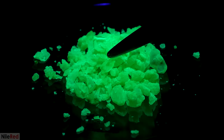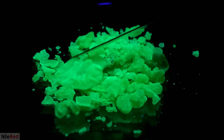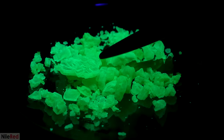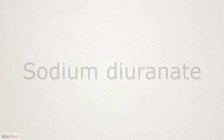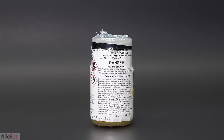This made me think that maybe to make uranium glass I could just directly throw the uranyl nitrate into some molten glass. However, when I looked it up, it didn't seem like that was the case. Out of all the info that I did find, it always mentioned using something called sodium diuranate. Based on this, and considering the fact that I'd never made uranium glass before, I figured it was probably best to use that as well. This meant the project was going to be a bit more fun because I'd have to do some uranium chemistry to convert the uranyl nitrate into the sodium diuranate.